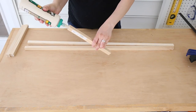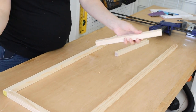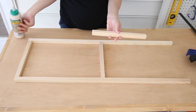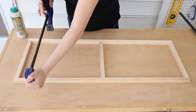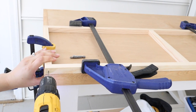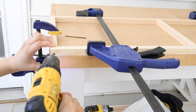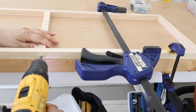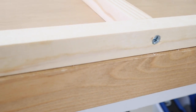The next step is to build the floating shelf frame support. Begin by adding wood glue to the ends of the three shorter square dowels, then build the shelf frame support with the three shorter square dowels between the two longer square dowels using one and a quarter inch wood screws. For easy assembly, clamp the frame together and pre-drill pilot holes for the wood screws and slowly screw them in to avoid splitting the wood. Make sure the screws are flat against the wood or a little countersunk beneath the surface, as this will make it easier for installing on the wall later on.